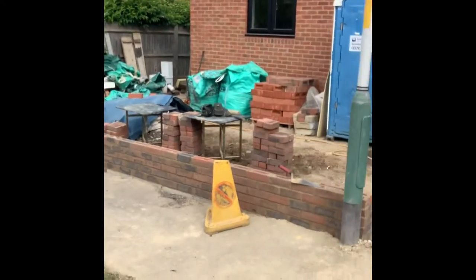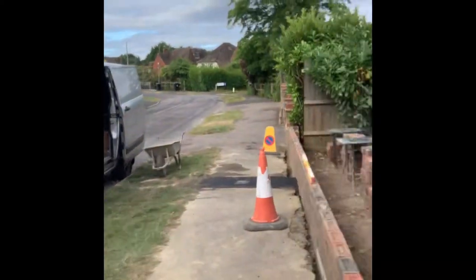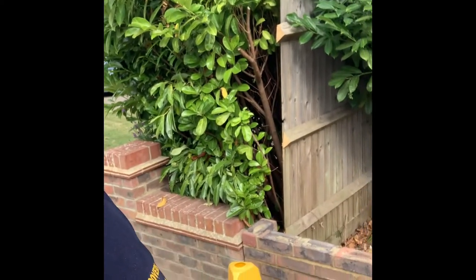Just a little look from the other end — that's where we got to on Monday. This is the inside, and basically going to get this one complete today. If you remember, it's going to be similar to this: tile creasing now on, brick on edge at each end, with three bricks on edge on top total — creasing so yeah, just getting set up. Let's get this show on the road.